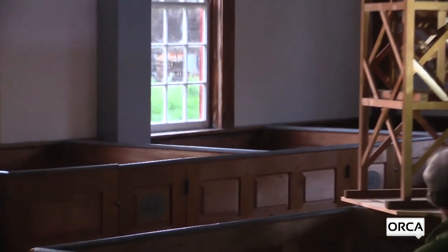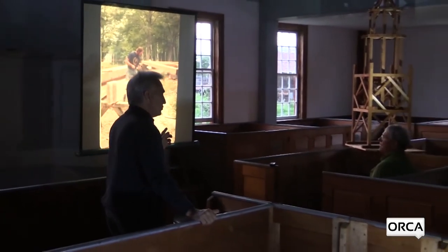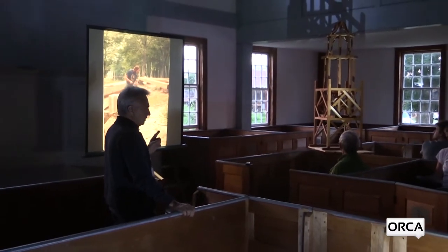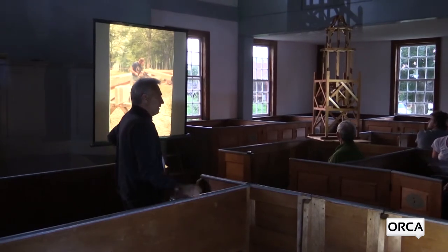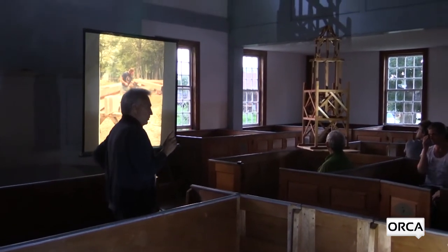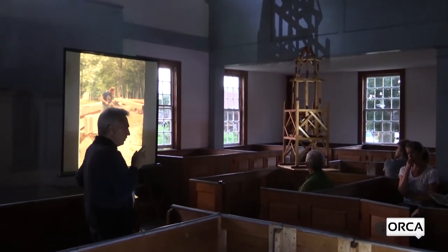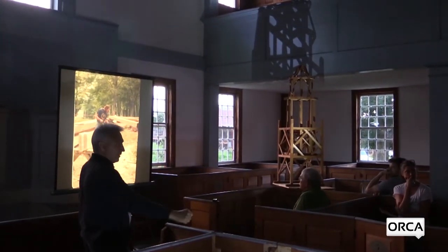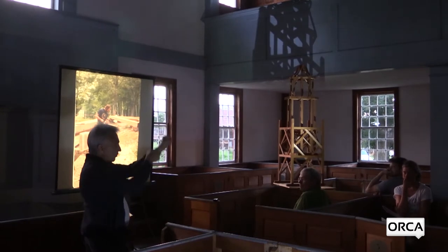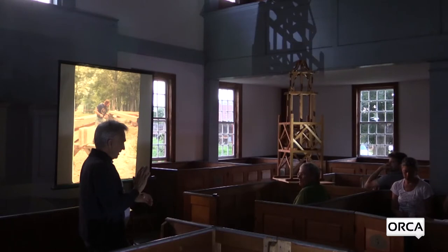But anyhow, it's a beautiful steeple. Something happened. I'm not sure what happened yet, but I've looked at hundreds of steeples. No framer would leave it like that, but someone did for some reason. I also read that this steeple was built by the same person who built East Montpelier Center Church. One interesting thing in it that's odd: remember I mentioned that the brace was coming down at the bottom of the mast only in one plane. They didn't go in the other plane at all. It's a little odd. You usually try and stabilize the thing in each direction.